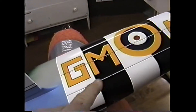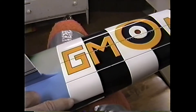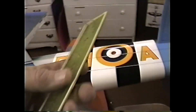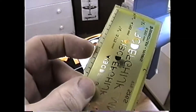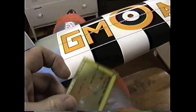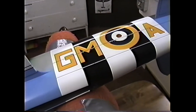I'll just let that dry and go over it again when I'm done with this side. Now I want to lay out using the flexible ruler — what I did is I marked up the rivet spacing, which is different even from the wing and the fuselage, so I have a variety. I can bend this right around, hold it in place, and just drop the dots in.